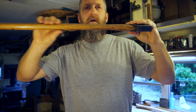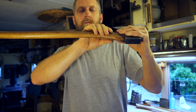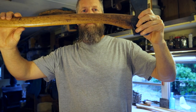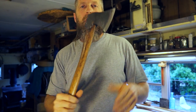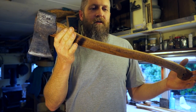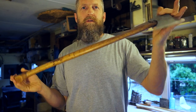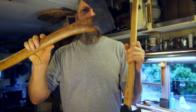On the way home I thought: okay, supposedly these guys have been making axes for a very long time — maybe I should bitch-slap my ego and try it the way it is. So I stumbled out into the woods feeling terrible, took a few blows on a tree, and it was exactly what I expected: a lifeless, thudding, clunky piece of crap. Beautiful handle, great wood. I stumbled back home, grabbed my rasp, and thinned this area out just to make it usable — kind of the way a felling hammer is thinned out right up near the head.